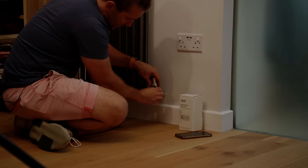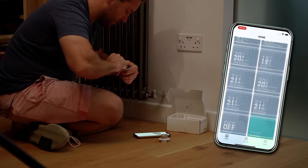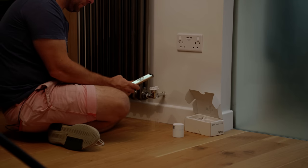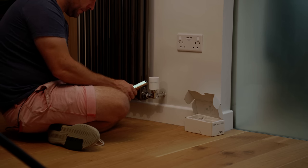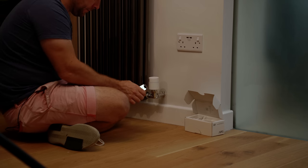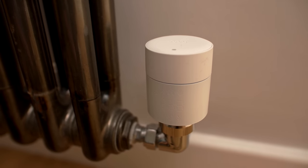I've now done every radiator in my house, so the app shows all of them individually. I can turn on one individual radiator and it will signal to the boiler and pump that heat is needed — so just that one radiator gets hot. A few important considerations: make sure you still have a bypass radiator, usually the towel rail in the bathroom. It's also good practice to install a bypass just after the pump, directly back to the boiler return, and to have a fully modulating pump so pump speed adjusts according to how many radiators are open. Overall, really impressive system.